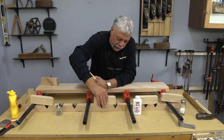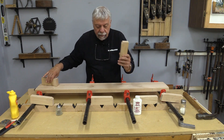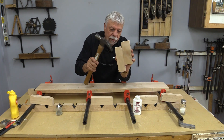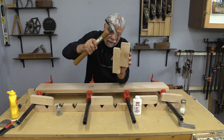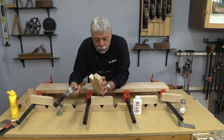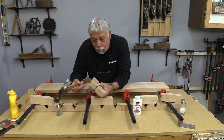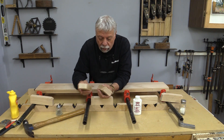You can see I've got all these little blocks here, and I've got them all labeled. What I'm going to do is glue them all to this long board here. If you look closely, you'll notice there's a little notch out of them — the purpose of that notch is so that I can use my hammer. After the glue is dry — I'm going to give it 24 hours — I'm going to see if I can pry that apart. I've taken apart enough glue joints in my lifetime that I know when you glue two pieces together and leave it for 24 hours, you can't pull that glue apart; it actually starts tearing the wood apart. So it's one way of finding out whether any of these products work out.